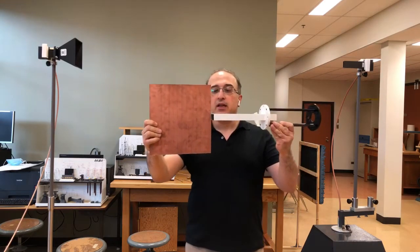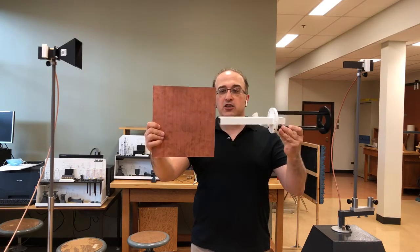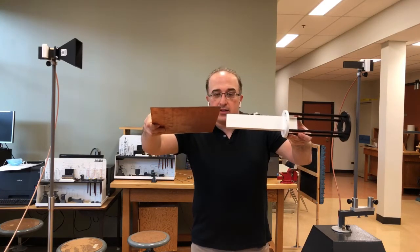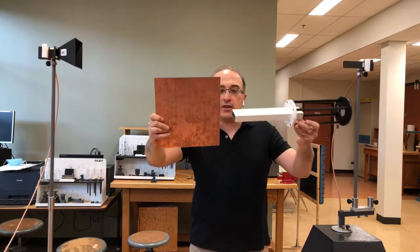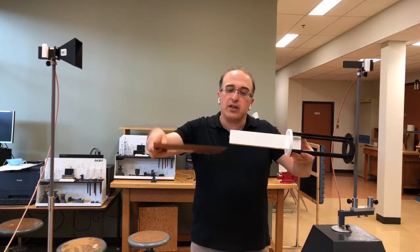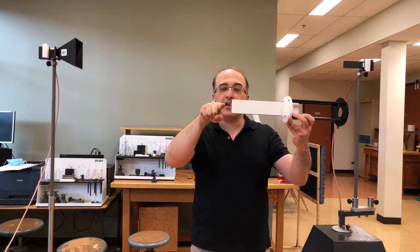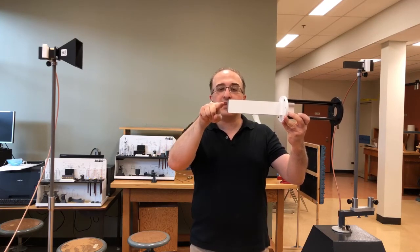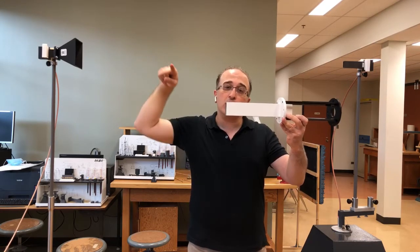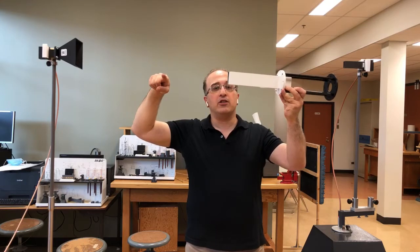If you want to measure the antenna in the E-plane, you need to rotate in the E-plane. This rotation is not straightforward, so what we do is rotate the whole antenna 90 degrees so we can still rotate in the correct plane. When the antenna is in this configuration rotating in the E-plane, the electric field direction is horizontal, so the transmitting antenna should also be horizontally polarized for copole E-plane measurement.